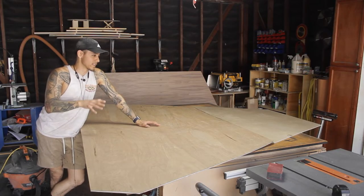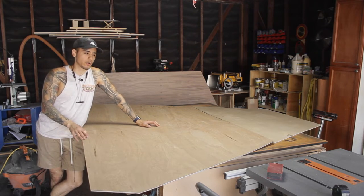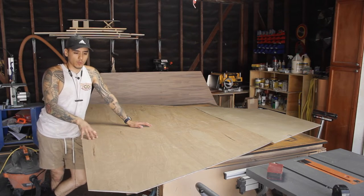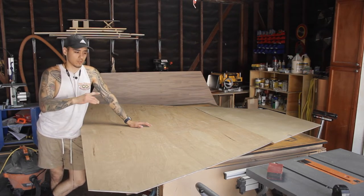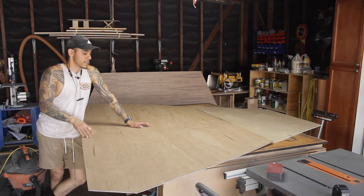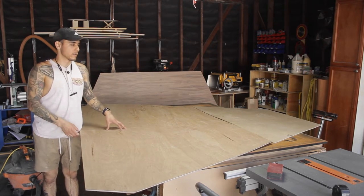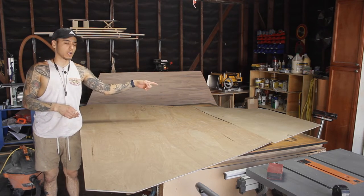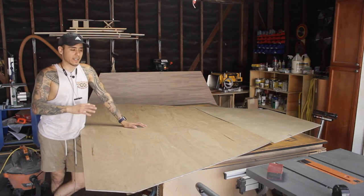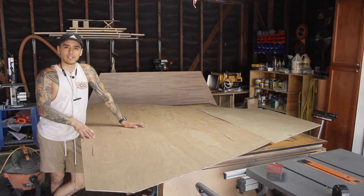This thing is absolutely gigantic. I'm just using two sheets of five millimeter underlayment board — it's really thin plywood that comes in 4 by 8 sheets, just like plywood, but it's a lot easier to work with so I can get the template cut out exactly to where it needs to be and then flush trim it on my actual work piece. I already cut out the bigger side on the walnut plywood, so on camera I'll show all the steps on the smaller narrower side.